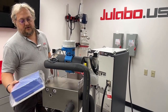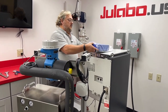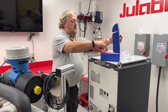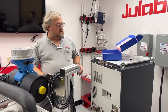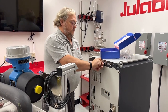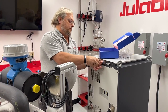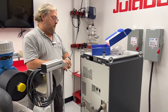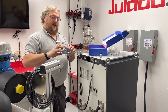One of the first things you're going to need to do is find the box with the flow control solution. This has a module inside that needs to be installed in the Presto. Depending on the model of Presto, you may have Phillips head screws or Torx head screws holding the plate on the rear of the unit. We recommend that you use an ESD wrist strap when putting the module in, just to prevent any chance of damaging the electronics of the module.